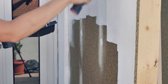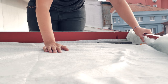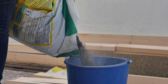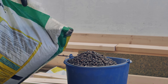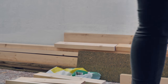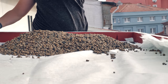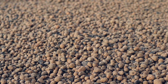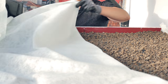I painted everything but the doors with some titanium white. The day I chose to make the grass roof had a lot of wind, so it wasn't very easy to lay things down. I placed a sheet of geotextile and some lightweight expanded clay aggregate on top to provide good drainage, then another layer of geotextile followed by soil and finally the grass in rolls.